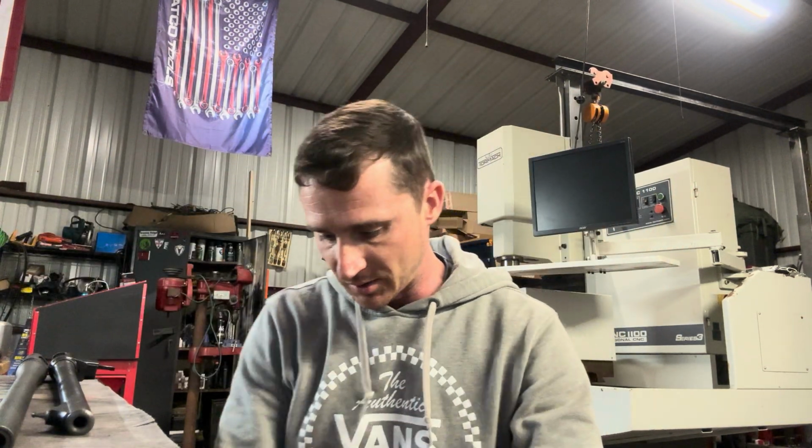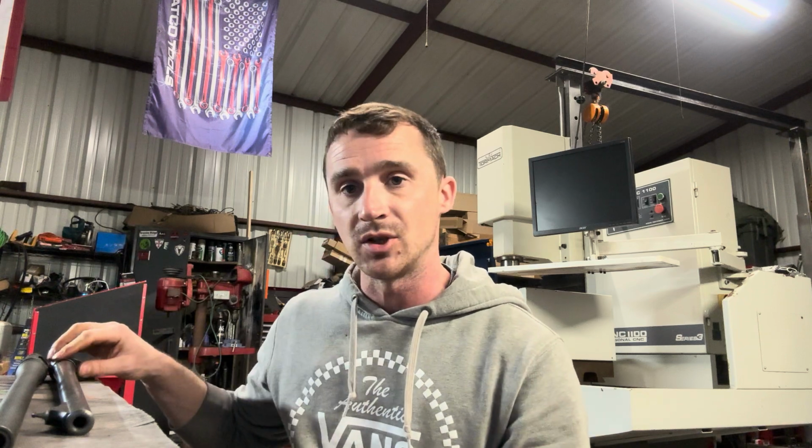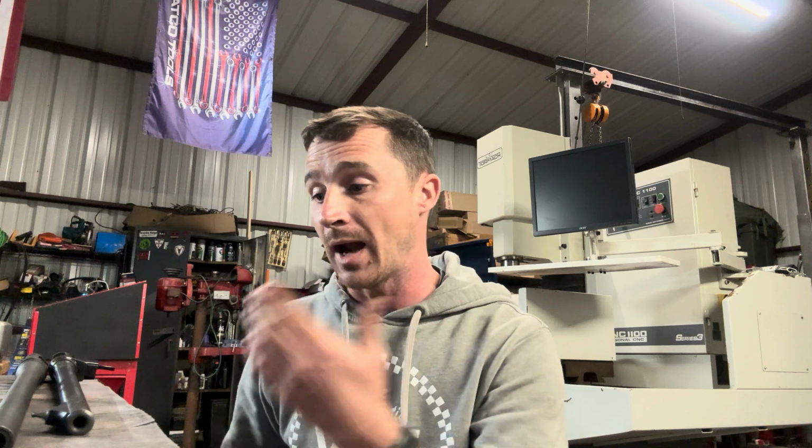I would say that if you are fairly handy and a do-it-yourself kind of person, a Savage style or a barrel nut style pre-fit is something that can be accomplished. I think there's some tooling you're going to have to take into consideration: your purchase price for the tooling, a vise, and an adequate way to hold this to not cause any damage. Headspace gauges, which you can rent, but ultimately I like to purchase them because they can be used forever.